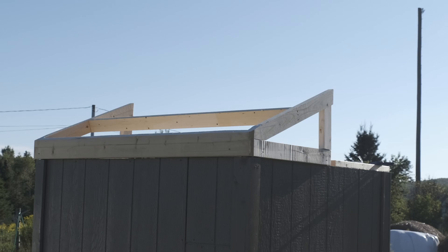For now, I had to build half the roofing frame to provide a support to hold up the tarps that will sit over the observatory to keep everything dry. Carpentry for the rest of the observatory can follow normal tolerance standards, but a split roof must be extremely precise — I'm allowing no more than a 32nd of an inch, and preferably less, of tolerance between the various cuts of wood. Just making one side of the roof frame was a process that took all day.